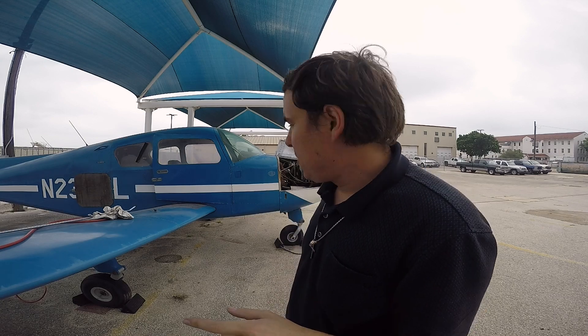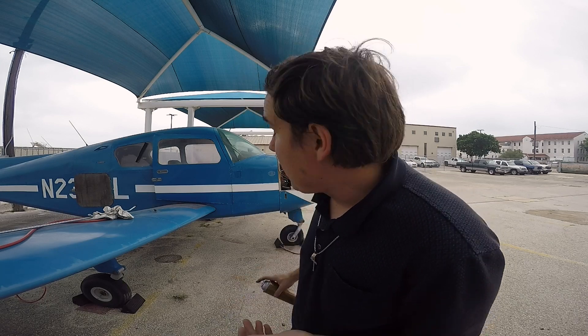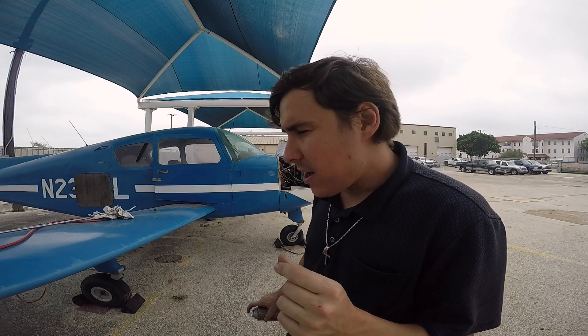So what I'm going to go ahead and do — I know that sounds weird — I'm going to give it a big shot of starting fluid, which I would normally never do on a certified aircraft, but this is at the school so who cares. I'm going to give it a big old giant shot of starting fluid and see if maybe it will fire over, because I'm not sure how the mags are working. I can't hear the induction vibrator firing. This is a shower spark system, so it's not an impulse coupling, and I can't hear the induction vibrator vibrating, so I'm not sure if that's working. But I'll give this a shot.